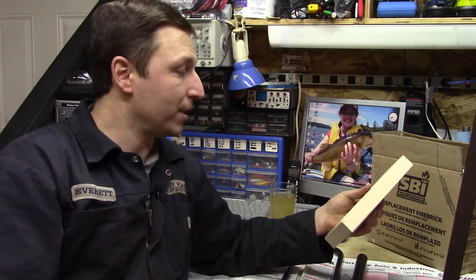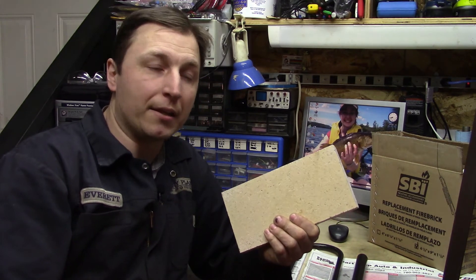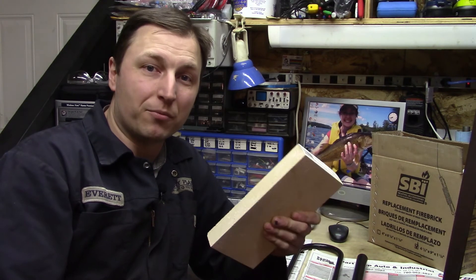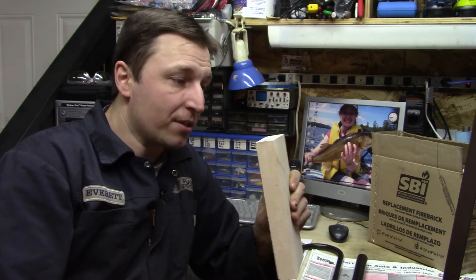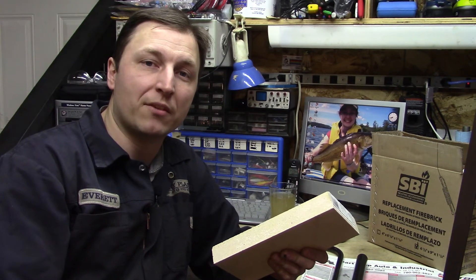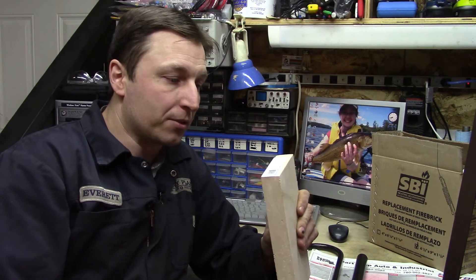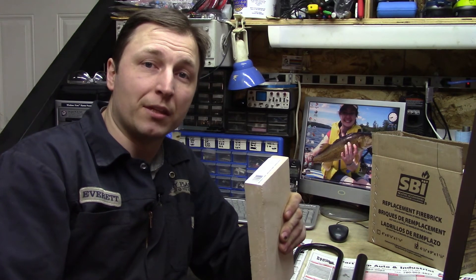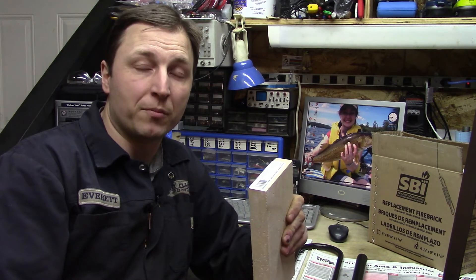What was fun this week was the fire brick came in. We're going to test heat treating — I finally got my fire brick, I ordered it a while back. Because I don't have space to set up a full-scale heat treating oven permanently, we're going to set some bricks up in a configuration to conserve heat and maintain reasonable safety, just so we can get a couple sample pieces up to red hot, quench them, and then temper them.